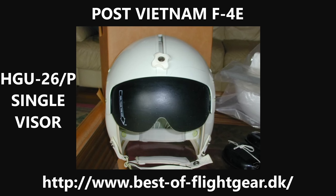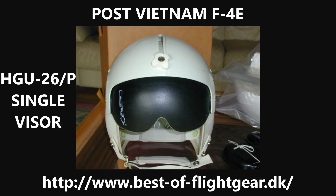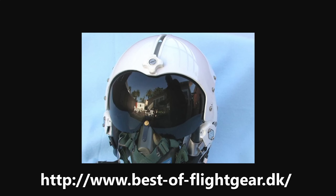This is the HGU-26P single visor, and this is what most of the F-4E guys would have worn post-Vietnam, prior to the HGU-55P — the lightweight gray helmet. I remember working on these. At Kadena in the F-15C days, when we'd get them, the visors would come stock and we'd have to grind them out with basically a Dremel tool — a little grinder — to create gull wing designs on the visors for a little extra visibility when they looked up. That straight line across the visor would block some vision, so we'd do this mod before mounting it on the helmet. Here's what it looks like with the mod done and sanded out nicely.